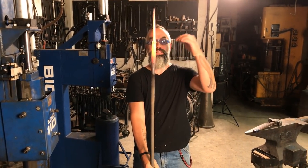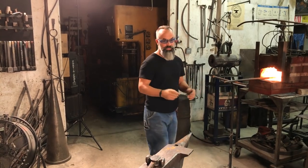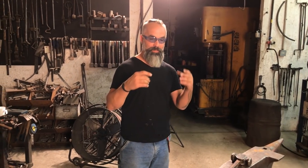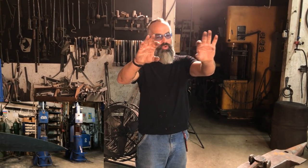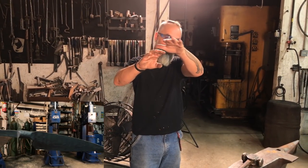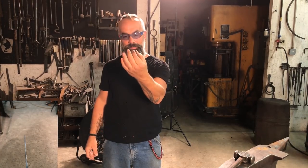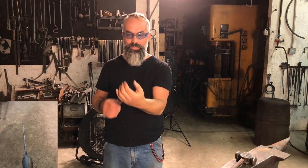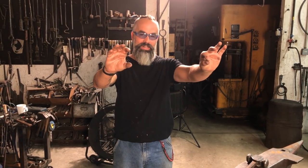Now what I want to do is draw the width of the blade — I'm going to use all this steel to make the width. Specifically, a chef's knife's performance is based on its ability to cut and pass through materials. It's got a really wide, triangular shaped blade with a subtle arc reaching down to the point. The width allows a transition from thick down to sharp. You don't want secondary bevels — just one wide blade, two to two and a half inches. Two inches over about seven or eight inches looks really nice and works really well. Seven inches is like perfect.